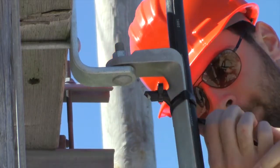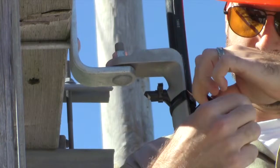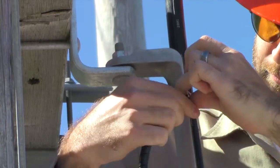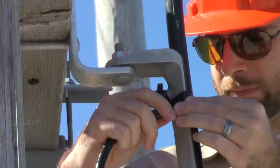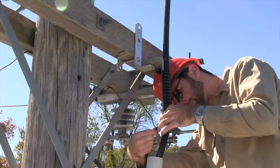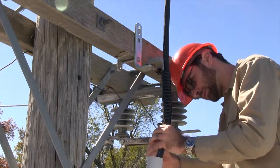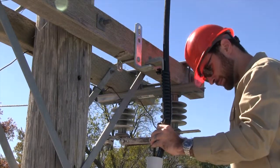Wind the cable wrap around both casting and conductor. The dull surface of the wrap must face out — or more intuitively, make sure to wrap going in the same direction as the bend in the cable wrap. Continue wrapping turns evenly until reaching the bottom tie horn. The turns should nest together evenly without the need to overlap.